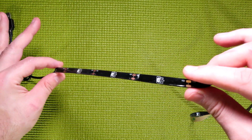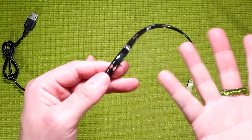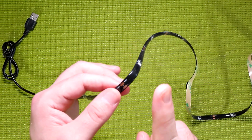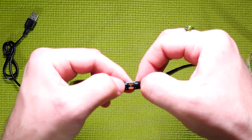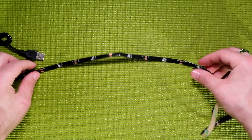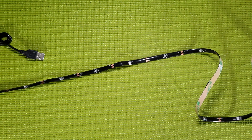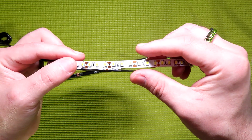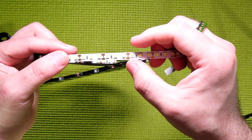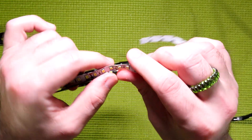If you cut in the correct spot, the LED strip portion connected to the USB cable will light up just fine. If you want to join these back together after wrapping them around a curve, or you just decided you don't want them cut apart anymore, you will need a soldering iron. You're going to peel back the weather protection and then solder the plus 5V to plus 5V, and the negative to negative. I do have an LED strip I bought online where the manufacturer actually spliced multiple strips together that way. This strip has the same style of copper contacts between each circuit, and they put a glop of solder on two different strips in order to join them together.